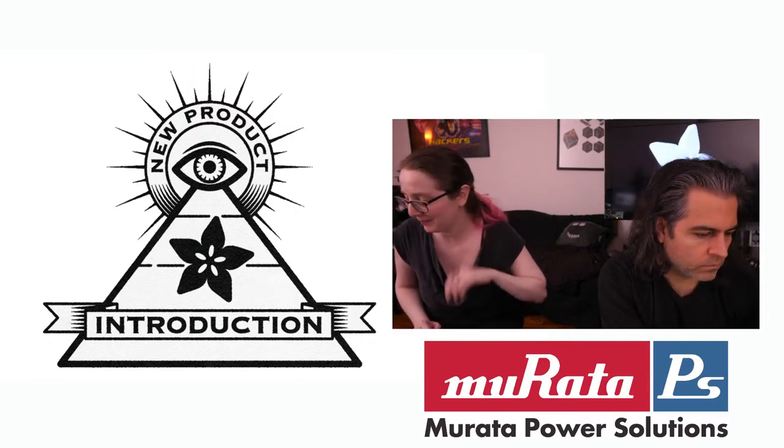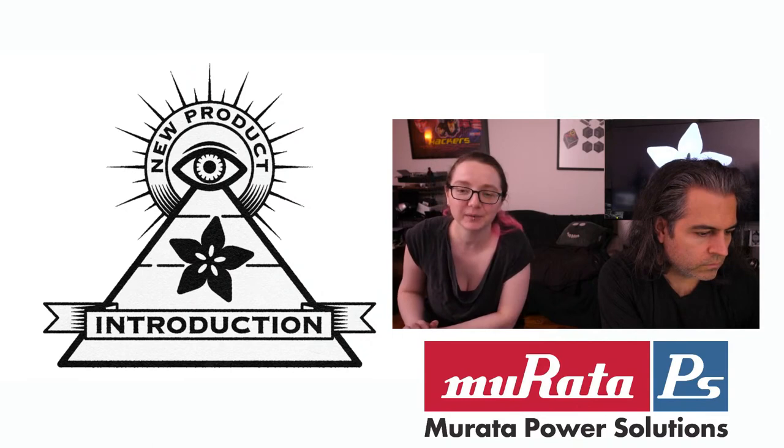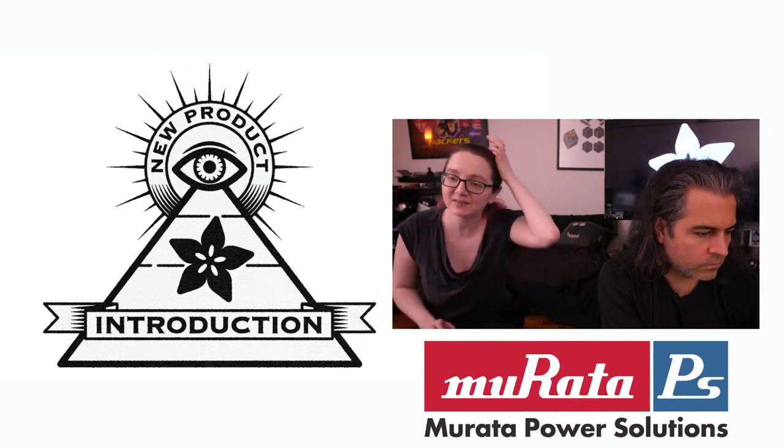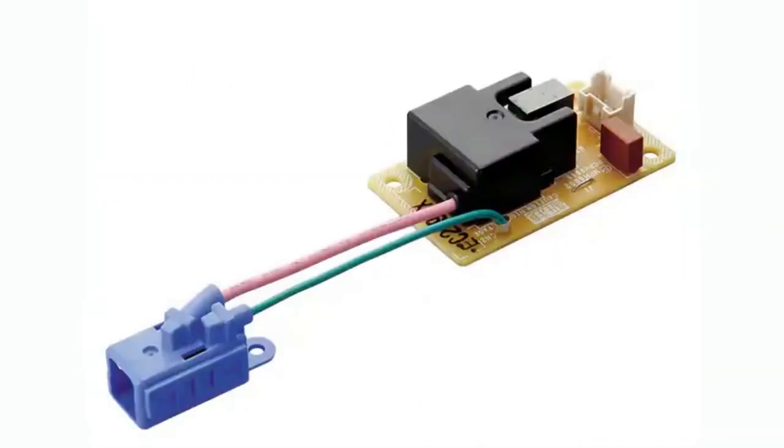So this week's NPI is for the MHM series of ionizer modules from Murata. These are chassis mount ionizers and ozone generators. Okay, so this is what it looks like. The blue thing is the actual ionizer. I guess it's got some ceramic that will actually generate the ions. And then the high voltage PCB has a high voltage power supply with, it looks like, a flyback transformer and all the control circuitry to generate it. And you basically just plug in 12 volts and boom, you get ions out, which is awesome.